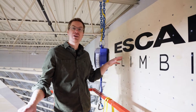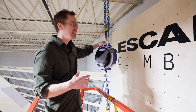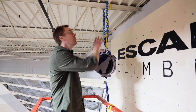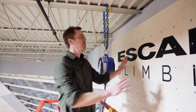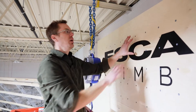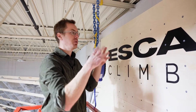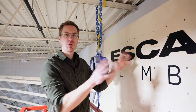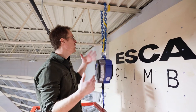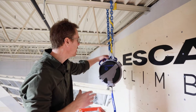Today I'm building a couple anchors for our climbing wall. In a commercial setting like this, steel roof joists are a really common option to tie into for an anchor setup. The other common option is building the anchors directly onto your climbing wall, tying into the steel structure behind — you're anchoring into the steel framing, never just into the plywood. Because of our steel roof joists and the layout of them, it works out nicely that we can use those to build anchors off of.